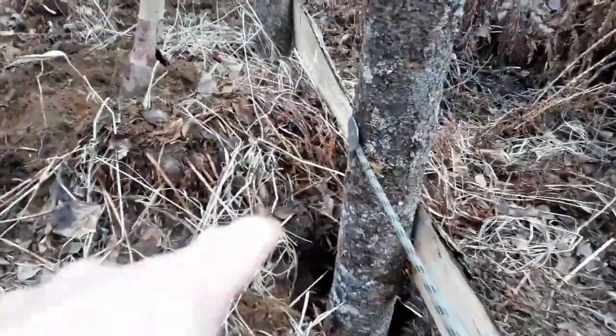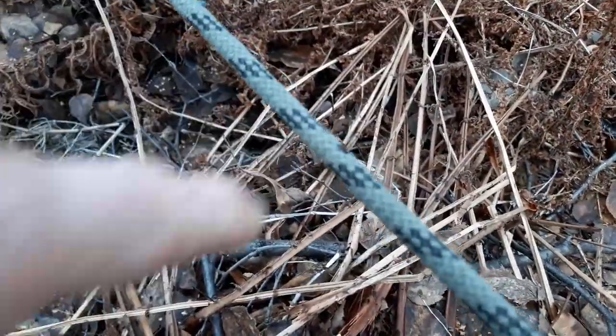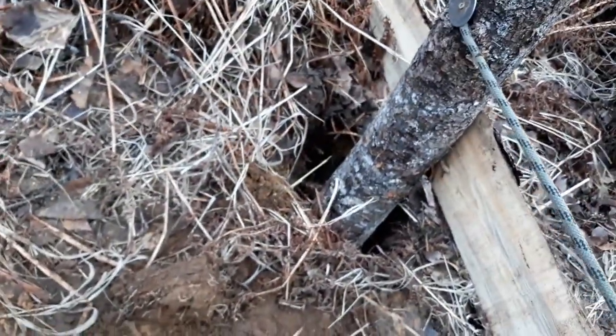I've got everything pretty much squared up as far as the first post on this far end. Now what I did was I marked a mark right on it, right there, and over to the corner here. That measures 3 feet. We go up this line, measure 4 feet right there. And then the distance between that mark and that mark has to be 5 feet, and it is indeed 5 feet.